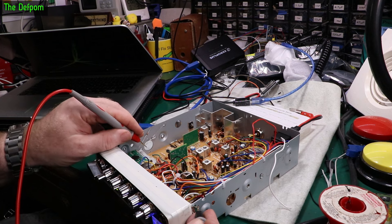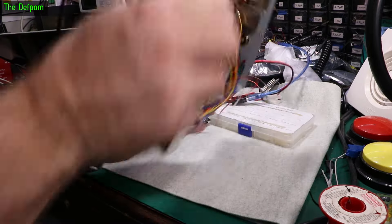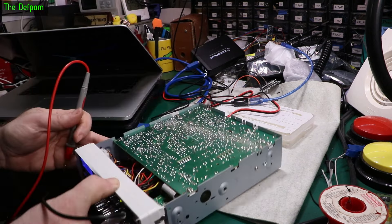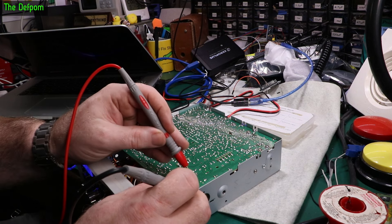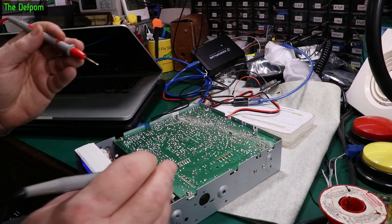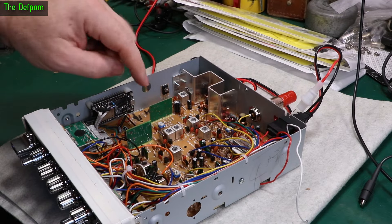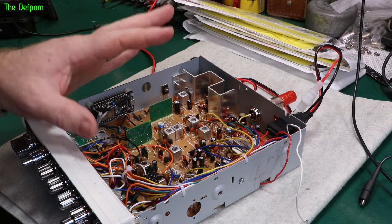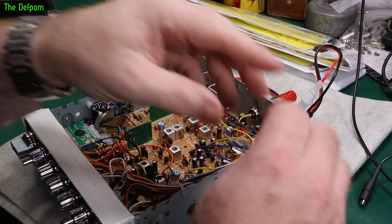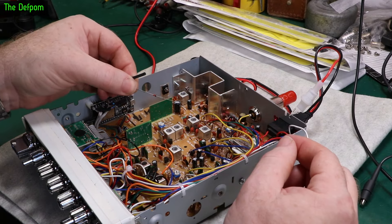There's 5V on the MCU side and nothing on the SDR IC side — perfect. That means I can use pull-ups to 3.3V on that side. This radio has TX/RX switching so the actual dividers change between TX and RX. I can't use a stationary frequency shift for the band offset — I actually need to use a separate TX and RX offset. So I'm writing that into the code now, but it also means I need to sense the TX state.